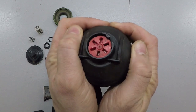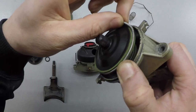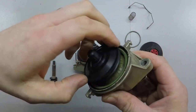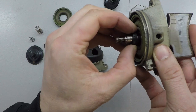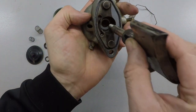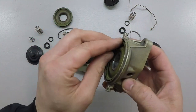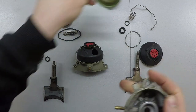Remove the retaining clip here. Just be careful — there's going to be pressure on the cap because there's a spring underneath. Push the valve up. You've got this spring retainer here; pull that off and then push the bellow down all the way around, and then this guy will unscrew. I believe it's a 10 mil if you need a tool. Again you're going to have a spring here, then on the shaft of the blade you're going to have this little retainer and an o-ring there, as well as an o-ring on the bottom side. To get the bellow off you can usually just pull that up. You've got a similar style spring down here.